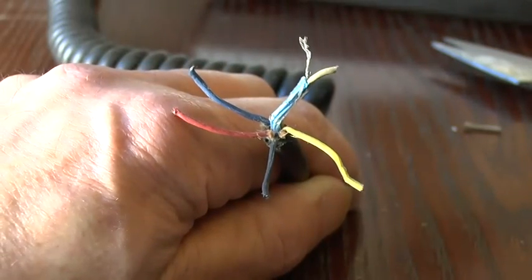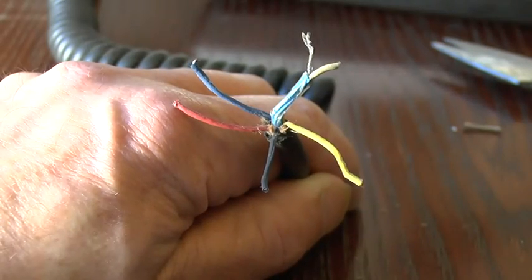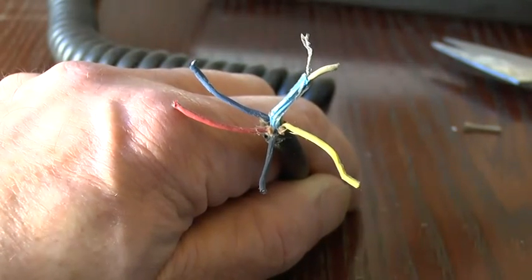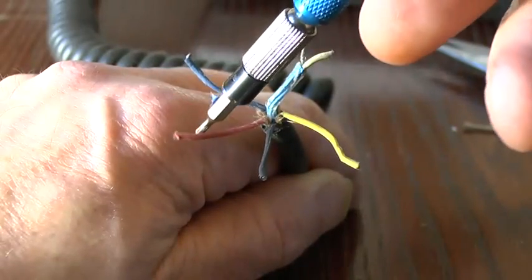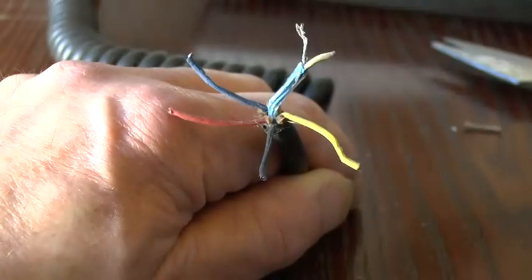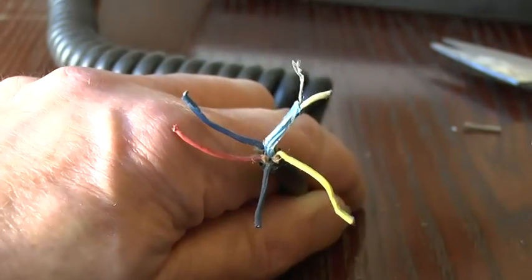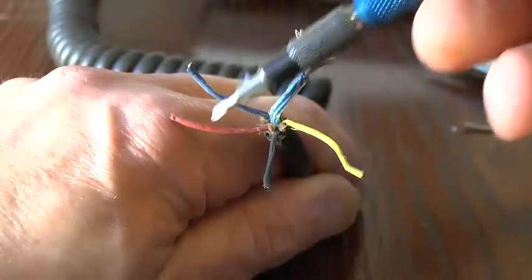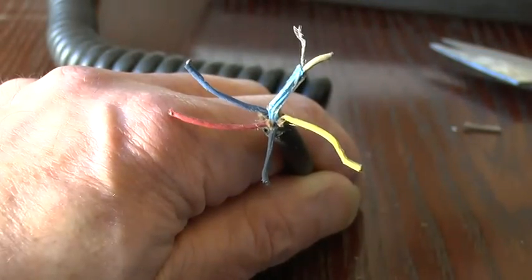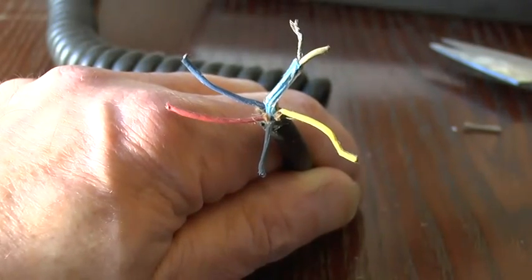However, having done a few experiments, I found that the only way — and I don't know why this is — the red lead is the relay switching lead for the Expander 500. The only way the microphone will work is to connect the red lead and the screen or the ground together. I don't know why — maybe somebody out there does — but that is the only way it will work.